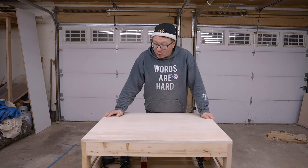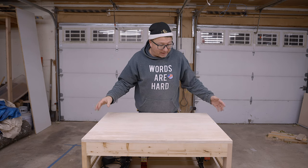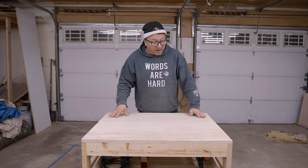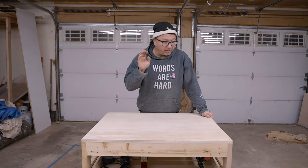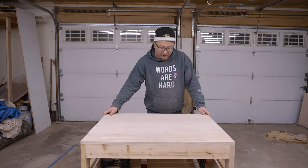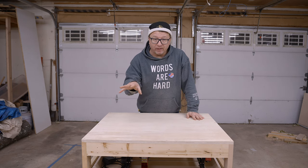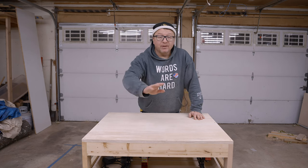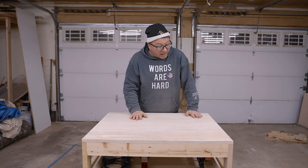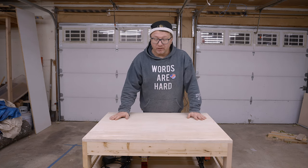That was the build video — I hope you enjoyed it. Let's run through some things I like about this design and then talk about what I'd change. Dimensioning the lumber was the right choice; having lumber that is true and square made assembly so much easier than working with raw dimensional lumber. Having this thing on casters really works well for my workflow — I'm able to move it around the garage wherever it ends up. Having the shelves on sliders so you can slide them in and out like drawers is definitely a bonus. I can slide the laser out, use it, and put it back. And having this big flat three-quarter inch plywood work surface on top is definitely a bonus — I think the Monport will fit well up there.